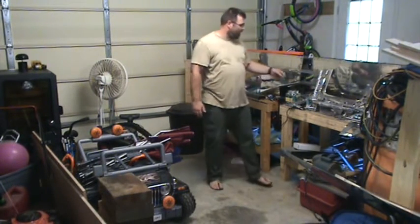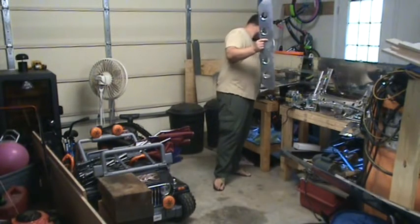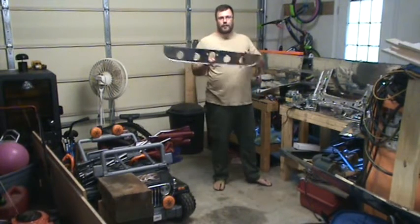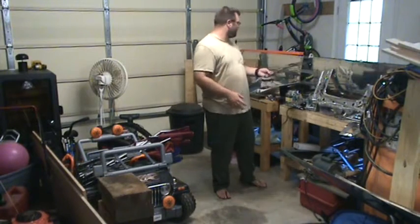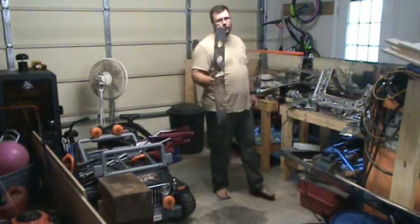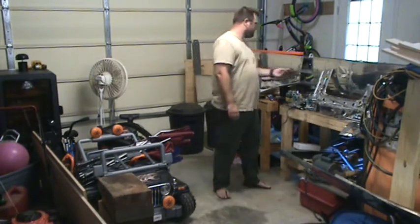And then step 5 is dimpling the 1006 bulkhead where it's going to get riveted together. So I'm just going to deburr that, do the dimples, set it aside. Especially on this, there's a lot of holes that get deburred later when you're attaching it to the front half of the fuselage.